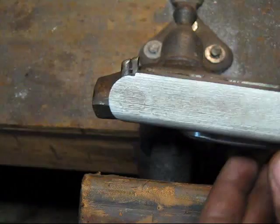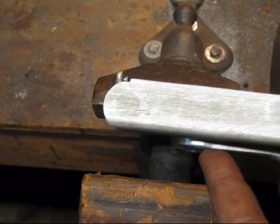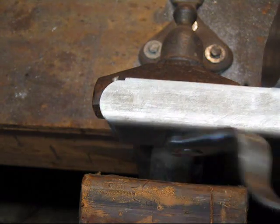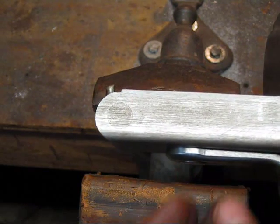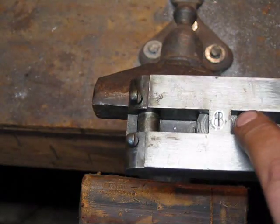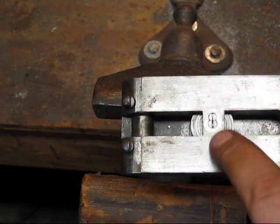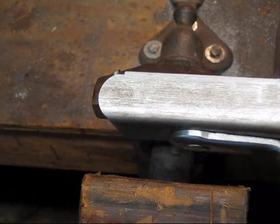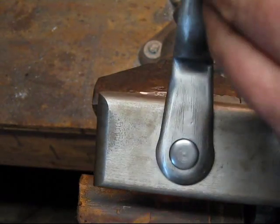The only thing special about this bolt is that the shoulders have to be properly cut. You need a shoulder that bottoms out against the under lever with just enough slack to give you a nice free rotation without binding, but you don't want it to slack off the bottom of the action at all. The clearance has to be really fine. Then there's a second shoulder where the threads actually shoulder up against the bridge in the action, bottoming it out. A little bit of precision cutting, but nothing particularly difficult — and it gives a nice, clean look.